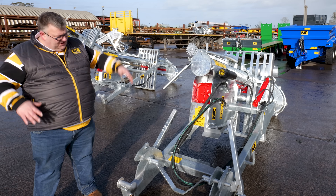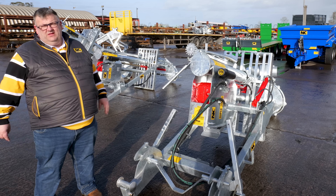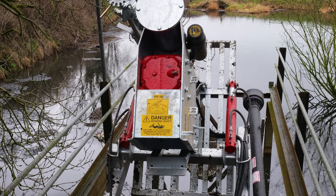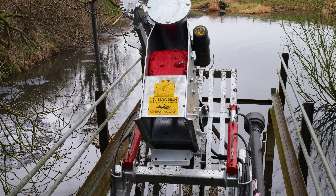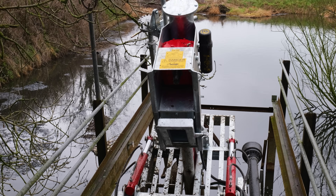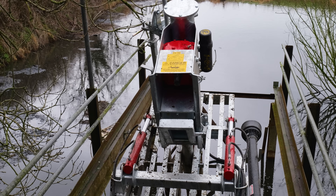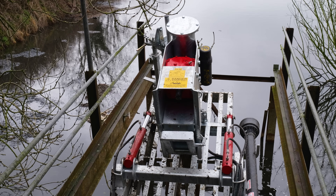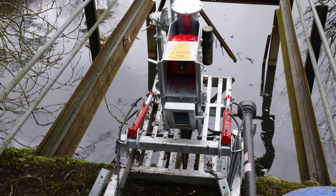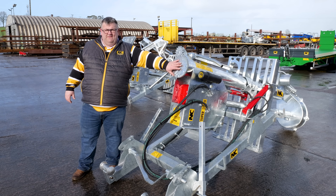It locks into a stand-up version and you put your feet down so you can hook it on and off. It doesn't work over centre, so with the weight of this pump, we have hydraulic cylinders for manoeuvring the pump when you're tipping it down into the tank. PTO shaft on, again 540. The 3800 pump does 3800 gallons per minute or about 17,100 litres per minute. It has the same blanked-off port on top for your top fill valve — 5 or 6 inch.